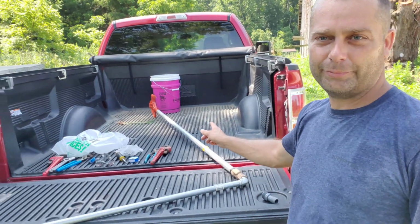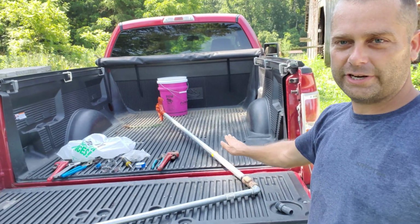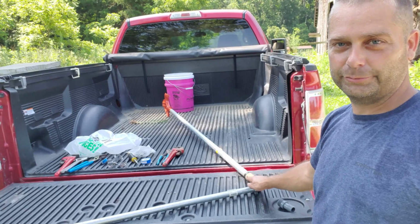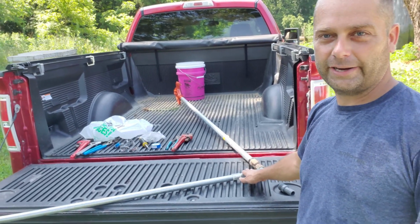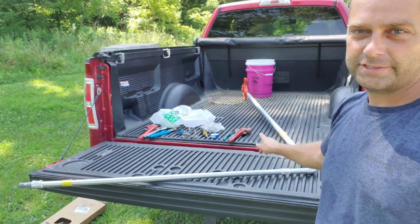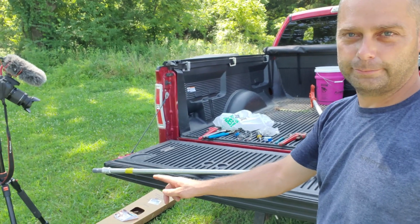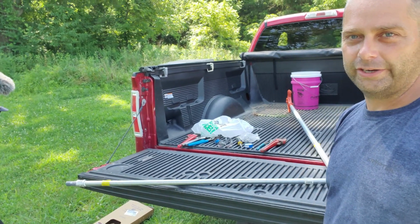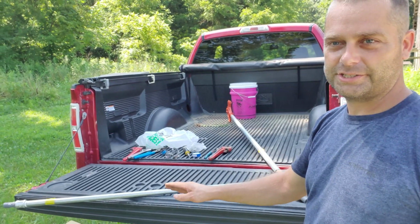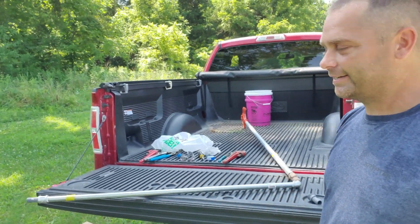Every time you operate that handle, you're going to move that handle up and down. It will stress this whole standpipe here, and this will flex in the ground and move in the ground, and we don't want to break that plastic barb fitting. So we got it further away. When you operate that handle, it won't flex the barb fitting because it'll be 5 feet away. That's just for reliability, so it'll help prevent us breaking that barb fitting and getting a leak.